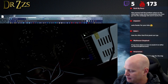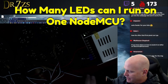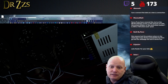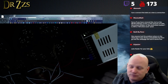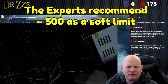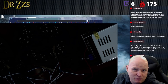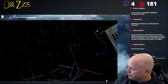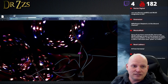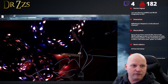One of the questions that I get a lot is: how many LEDs can I run from one NodeMCU? The answer is, I don't know. The answer from AirCookie — his recommendation was like 500 or 600. I wanted to kind of show what happens, or if anything bad would happen. I don't think anything bad is gonna happen. What we're gonna do is run 750 LEDs and see what happens. So this is 750, and there's no problems right now. There's nothing wrong. Everything's working fine.